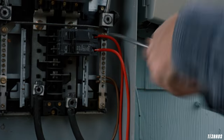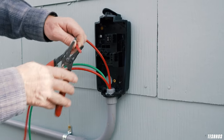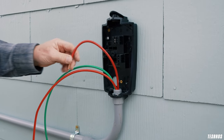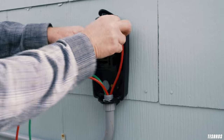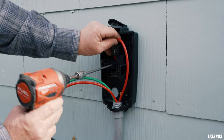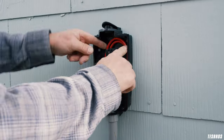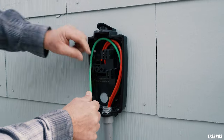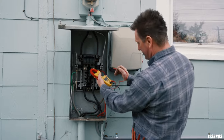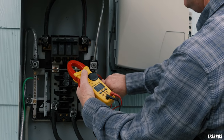Once the panel side is done, loosen the three screws on the charger's wiring terminals. We came from the top, so leave just enough slack. Strip the wires — again three wires: L1, L2, and ground. The reds are the hots and the green is the ground. Insert the first wire into its slot and tighten firmly, just like you did at the panel — loose contact is not acceptable. Do the same for all three wires. Keep everything clean; good cable management is important. What Michael does really well is neat, organized wire routing. Once that's in, turn on the breaker.